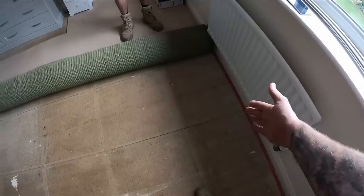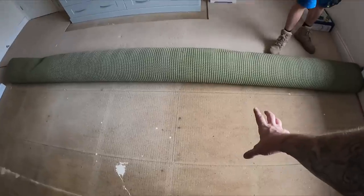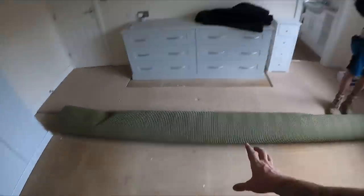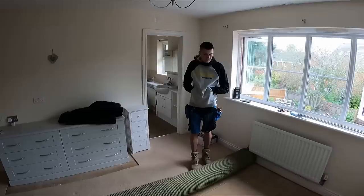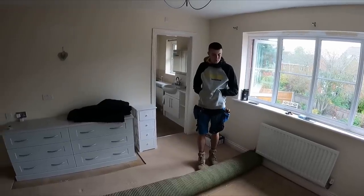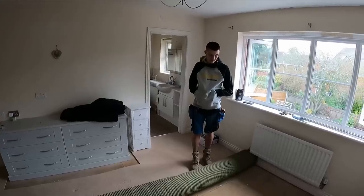When there's the joist here, we're not having any downlights directly at the end. So we can do a cut there. We could take this board out if we wanted to. Should we take full boards up, or should we do the slither like I said? Maybe just do a sliver straight down the middle, take it out and just screw it back in.